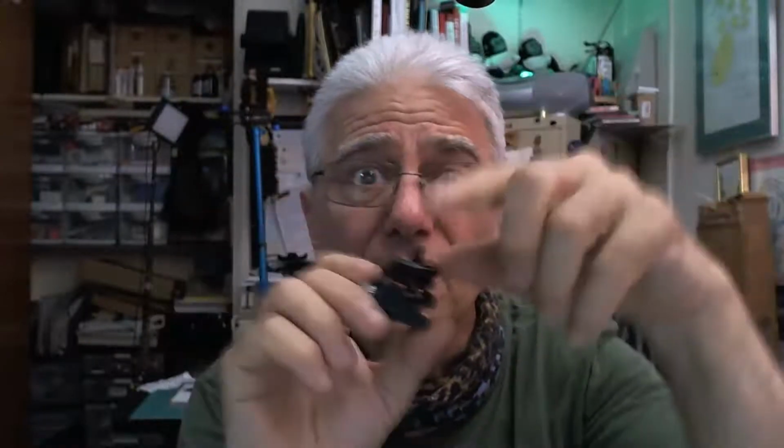So this is something that you might use, Fraser. Also, they do have mounts that go for the iPad mini. And this thing, you could screw this part into the frame mount and then have this, another option of many. You could screw a screw into the top of your walking stick and then put it on like that. Here, I'll show you. Picture this being the top of your walking stick. You take a piece of all thread rod, about 1 inch long. You can pick it up at Home Depot. Just drill a 1/4 inch hole in your walking stick right down the middle, and about 1/2 inch in, put some epoxy glue down there, put the all thread in, and you're all set. You have a mount.